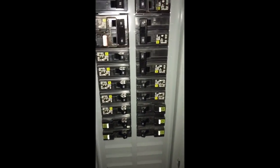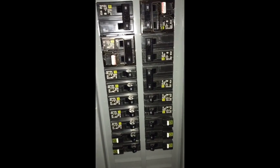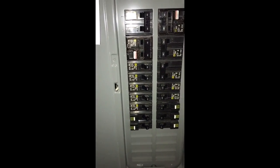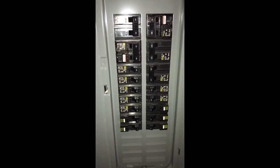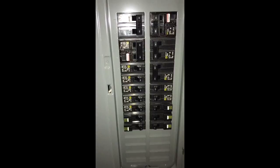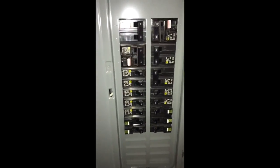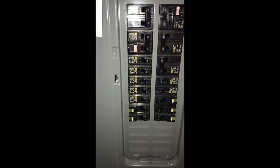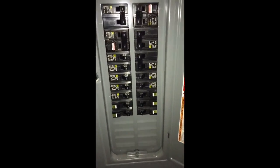The dishwasher and washer are 20 amps; utilities get 20 amps. Sometimes houses come with 10 amps or 15 amps. If you own your house, you can change these out and make a larger fuse amperage, but you have to make sure you also feed in the correct gauge of wire. It's like putting a three-inch hose nozzle on a one-inch hose — that nozzle isn't going to do much; you're still limited to the capacity of a one-inch hose.